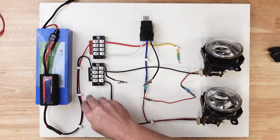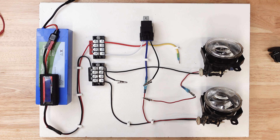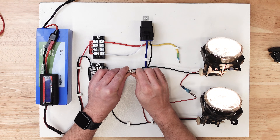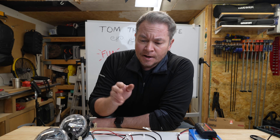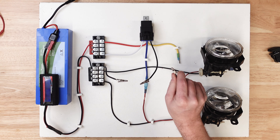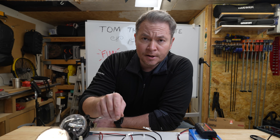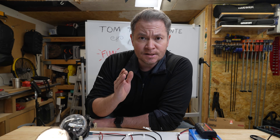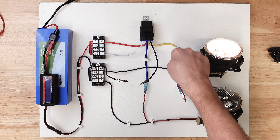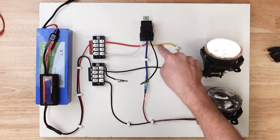What's happening here is power is coming from the battery via the red wire to the power distribution block, and through the red wire to the relay, where it can do two things: it can either go out to the yellow wire or the blue wire. It's only going to go to the blue wire when you energize the relay. Now, this yellow wire is where power goes when the relay is off. So if I were to take this front light and change its power lead to go to the yellow wire, the light comes on — because I've connected this load to the normally closed portion of the relay. When the relay is off, power is going through the red wire and out to the yellow wire. When I energize the relay, I'm going to redirect the power from the yellow to the blue.